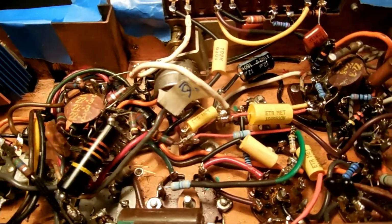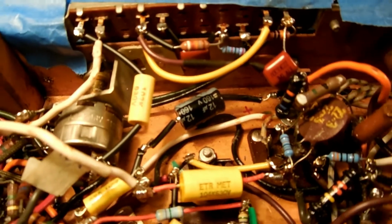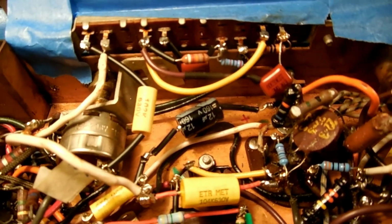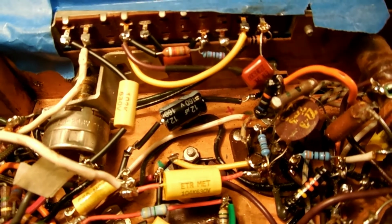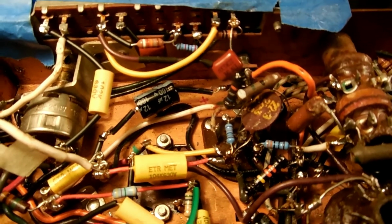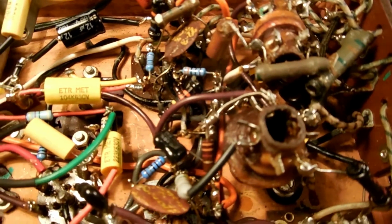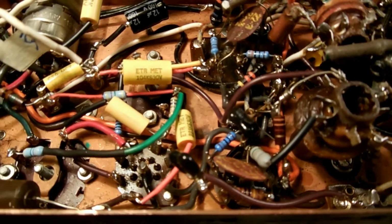So moving along, as all of the tone control components, all of the components are either way out of tolerance or just within tolerance at the end of their, if you do a little math with the 10%, or the capacitors, I figured at least 20. I know they say the old ones you go as much as 40% over, but anyway, while I'm here, I'm going to freshen it all up and see if we could get this baby percolating.